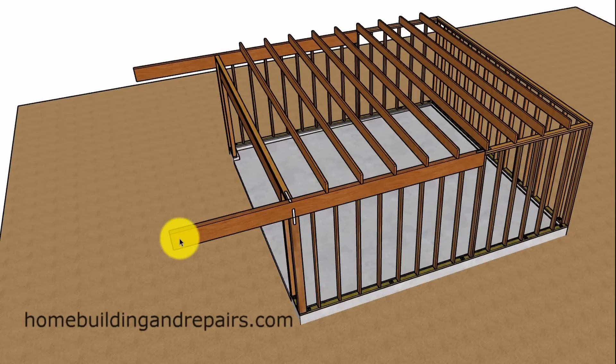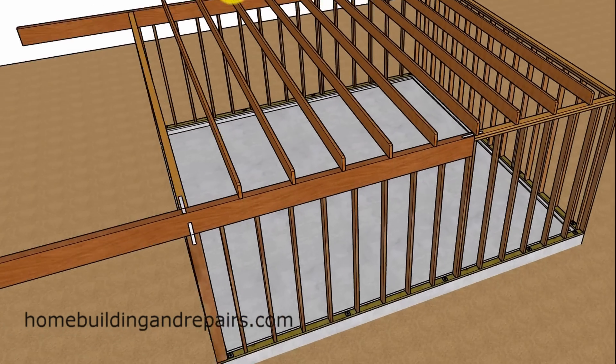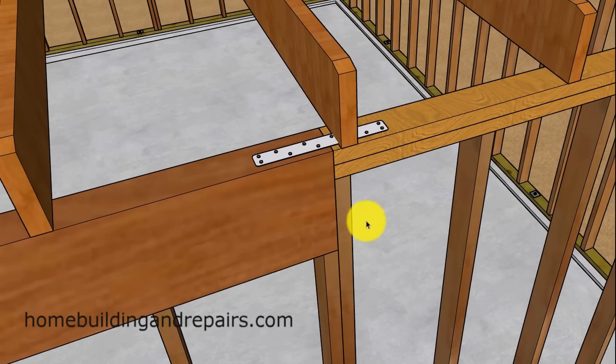If we use the overhang and multiply it by two, that should probably do it. So if we have a six-foot overhang, we're going to need to go back 12 feet. I have another video on that — cantilevers — but that usually isn't too difficult to figure out. These are just examples; this might not work for your particular project.